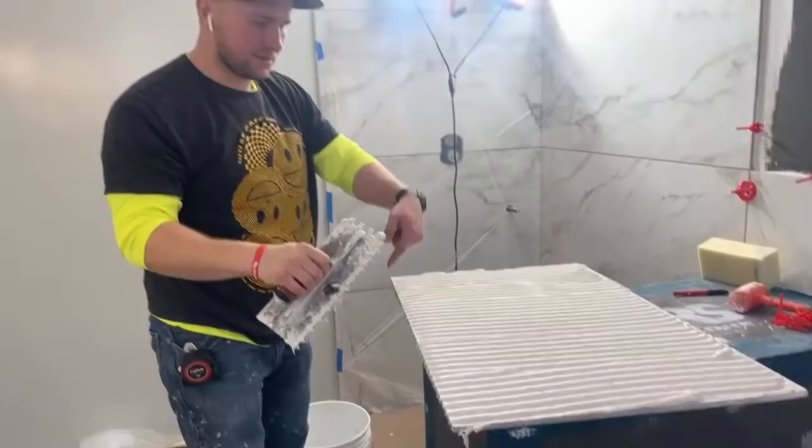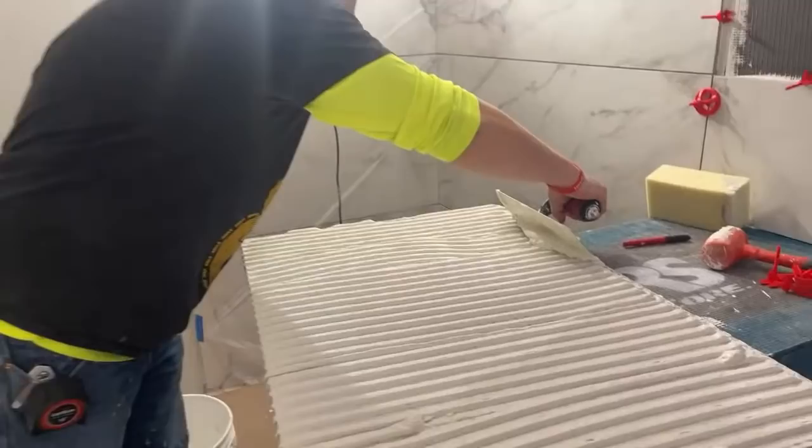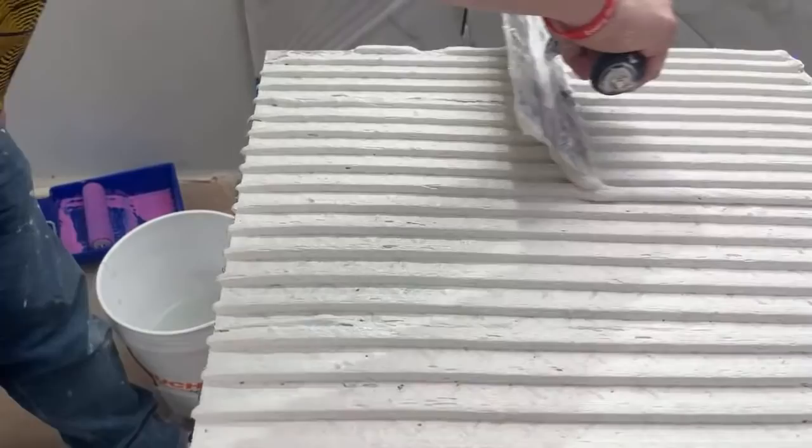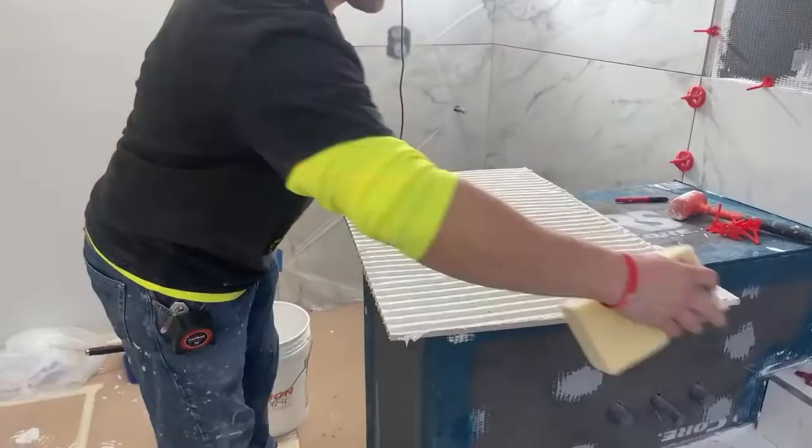So when you're doing this troweling out, if I angle my trowel like this a little bit, then all this thinset gets forced to the side and doesn't make a weird thing here. See how this side is super clean? See that? It's kind of a little trick for you. Little trick from the army. Was that in the army? I'm sorry, I did not mean that.